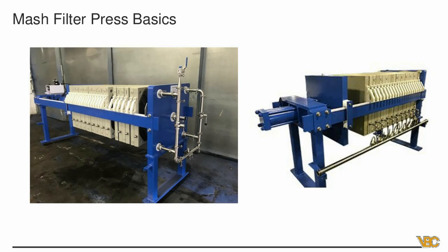Here are two basic shots of the press. The press on the left does not have the squeeze bar manifold on it, which I'll explain later. That angle gives a really good view of what the inlet and outlet manifold looks like. You can see some black on the inside — that's the cloth, from a specific application we did. The picture on the right is the exact same press from the other angle, showing the pusher plate and a good side view of the manifold and squeeze bar.